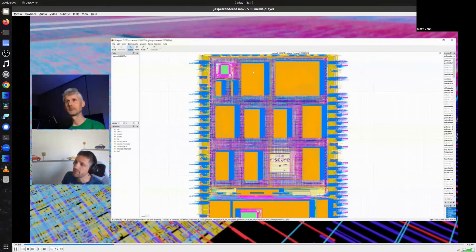We have two PicoRV32 cores: a smaller vanilla one — just PicoRV32 unadulterated — and a larger one with fault injection countermeasures. In our fault injection simulations, we take a PicoRV32 core, load a program on it, and during the simulation we start flipping signals, bits, and registers, then monitor what happens to execution. Lots of weird corruption occurs, but that's essentially the model we use for simulating fault injection.